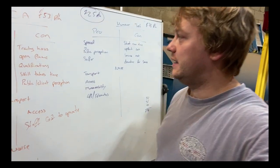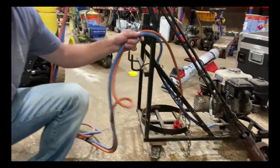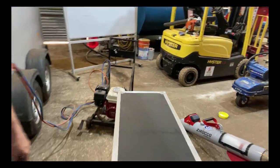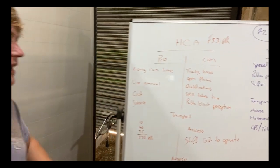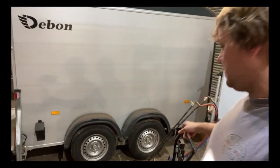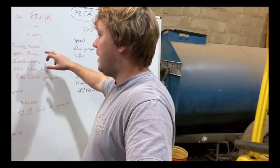Next are the cons. Trailing hoses is a big one — one of the reasons I really don't like HCA lances. This hose must be three, four, maybe five meters long. I don't like trailing hoses; they're a trip hazard, they're dangerous, there's no need for it — it's increased risk. If you're using one on the back of a lorry or a towable HCA, yours are going to be much longer and a bigger trip hazard. Next is the open flame: this one has an open flame on it and I don't see the need, and it's a massive con for me.